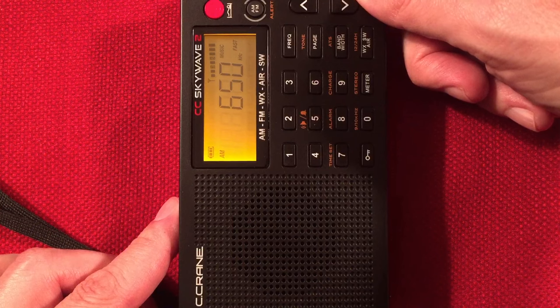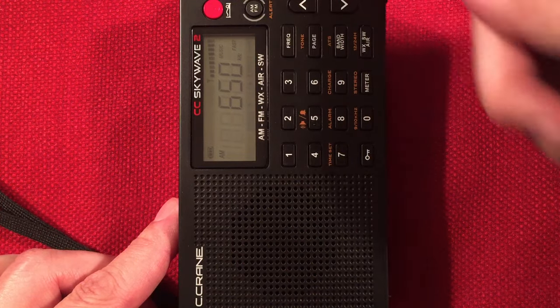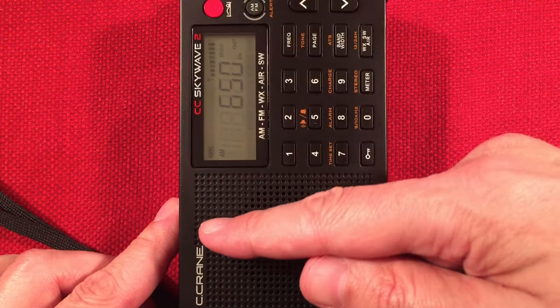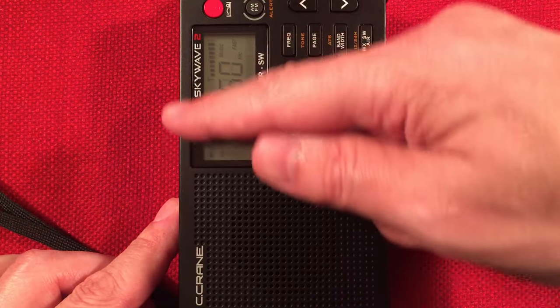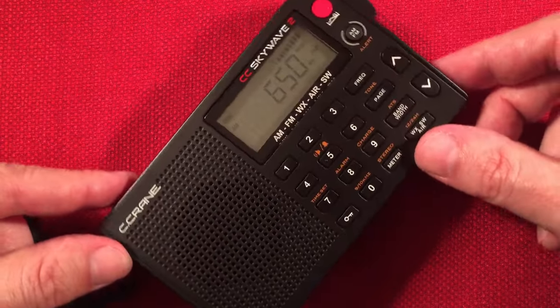There you go. You got some awesome country music at WSM, Nashville, Tennessee, 434 miles to the south. Of course, you see me turning the radio. It uses, I believe, a 2 3/4 inch ferrite internal antenna, and of course you have to turn that antenna horizontal edge towards the station you're trying to receive.